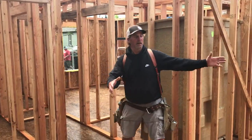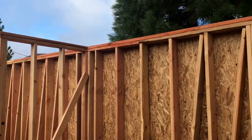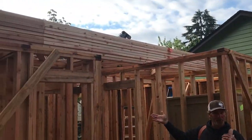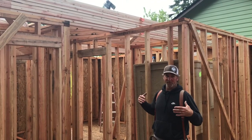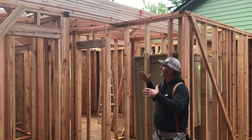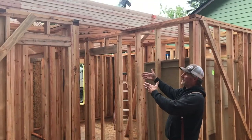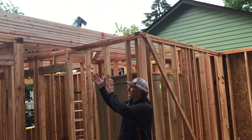Anyway, this is kind of an open area. I can't just bring trusses out here and set them. I need to set them on the walls, because trusses aren't very strong when they're laying flat. That's not the way they're intended to be used. So anyway, sitting on the walls, that's fine. We'll work entirely from this end. So I set this bundle here.